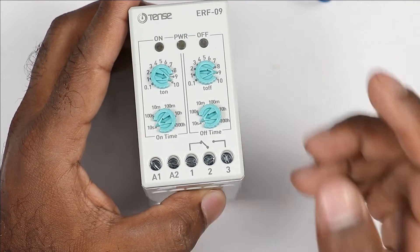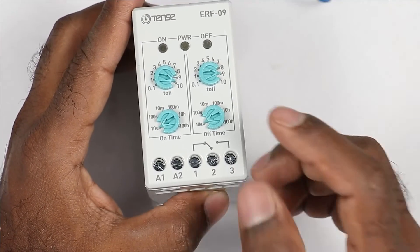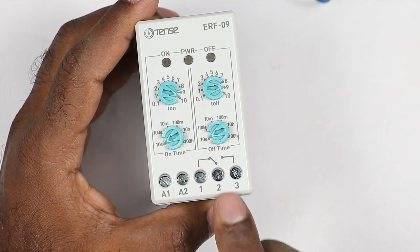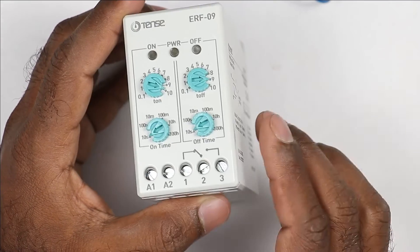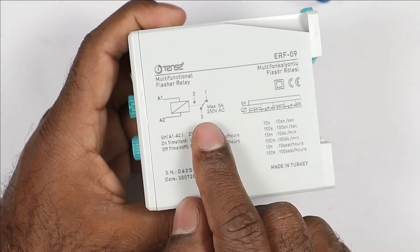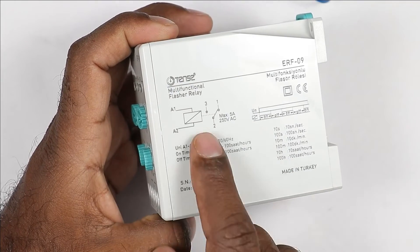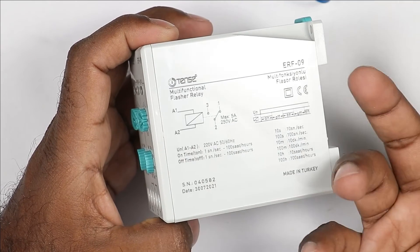What you have to do simply is: at the A1 and A2 terminals of this relay, phase supply and neutral supply are to be connected. After this, at this terminal, we connect wiring for the contactor. It means a simple connection is there. You can see this connection in the circuit diagram here. This circuit diagram looks very simple — anyone looking at it finds this connection very easy.